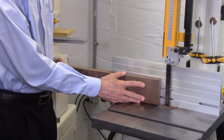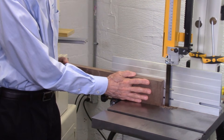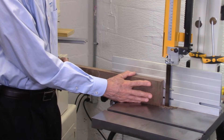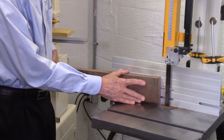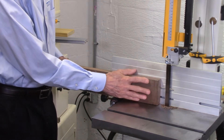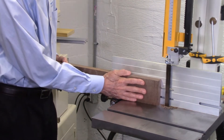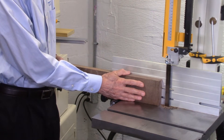When you slice wood on the bandsaw, you guide the board against the fence, pushing the board against the fence while also pushing it into the bandsaw blade. This can be quite dangerous since your fingers and hands are quite close to the blade. In addition, it's quite hard to cut perfectly straight boards with no blade drift or burn marks. The bandsaw table and fence may be too small, or the board may be too large, too long, or not perfectly flat. Any of these issues will result in movement of the wood, causing blade drift, burn marks, and uneven cuts. Any change of pressure against the fence, repositioning your hands, or even shifting body weight will result in bandsaw blade marks and drift.